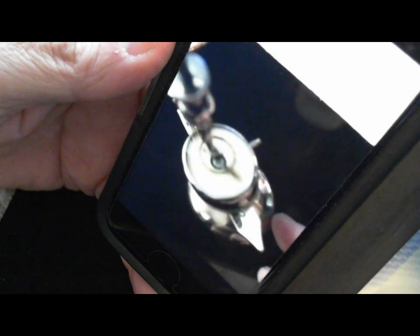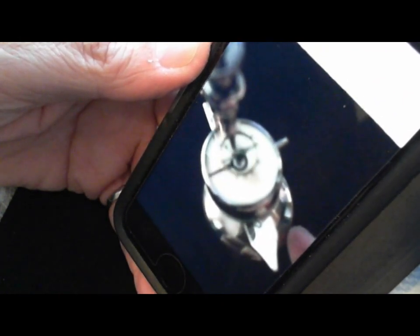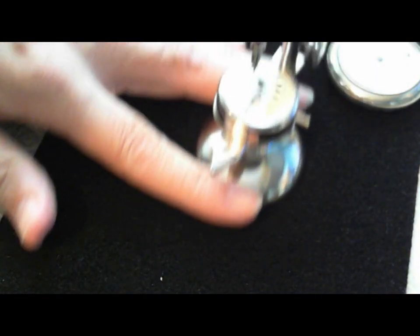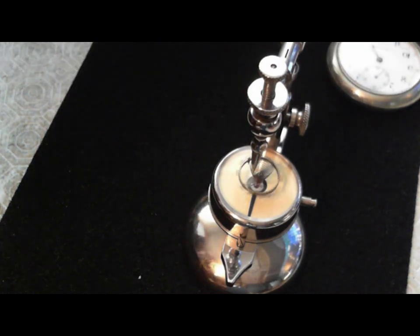While it's being videotaped, I can show you whether the master is faster than the balance I have set. Looking at the slow motion video — it looks as though the master on the bottom is moving faster than the balance. It's pretty hard to see on the camera, but what I need to do is shorten the hairspring. The master was gaining on the balance.